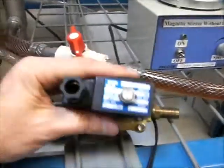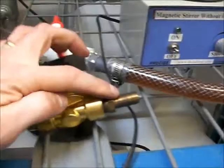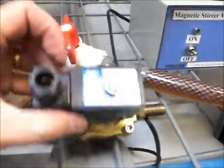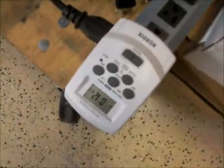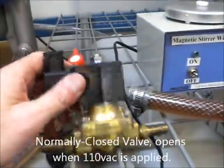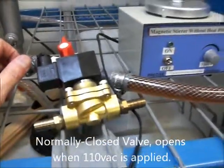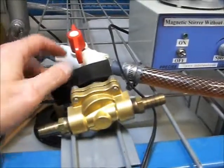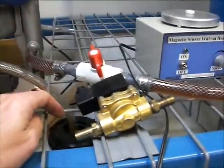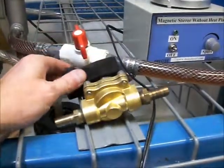This water valve here is for the wash water — you've got your hot water coming in and your hot water coming out. It's a 110-volt coil that's going to be controlled by a timer, just like the timer I've got here for my biodiesel pump. So you can use a countdown timer on this, and I'm going to time it so that my wash nozzle at the top of the processor adds about five or seven gallons of water and then shuts off automatically. Essentially you can just set your wash to go, walk away, and come back with just the right amount of wash water in your processor.